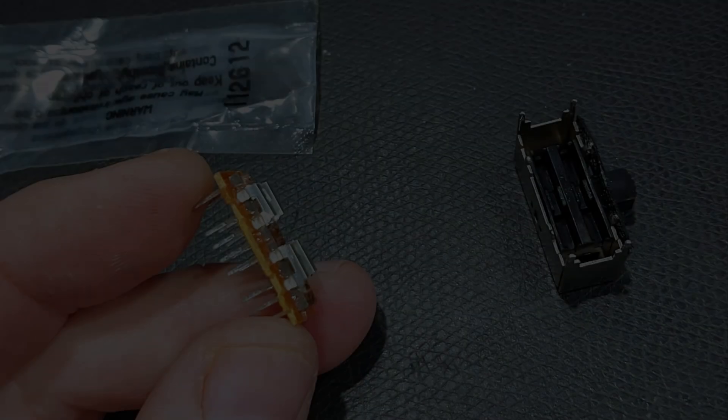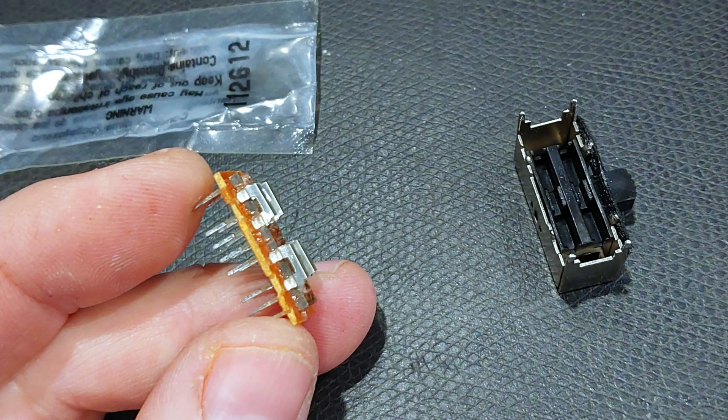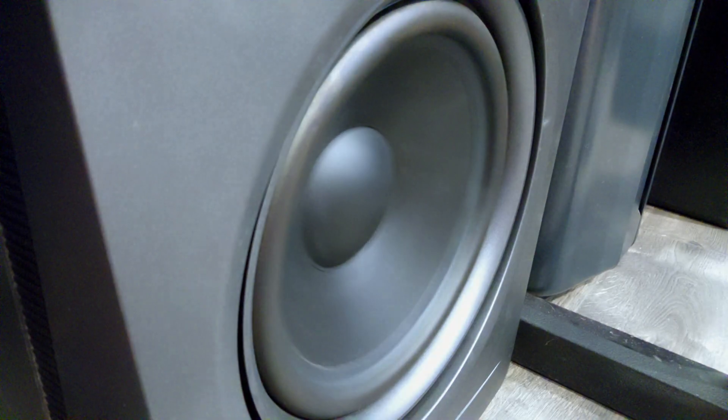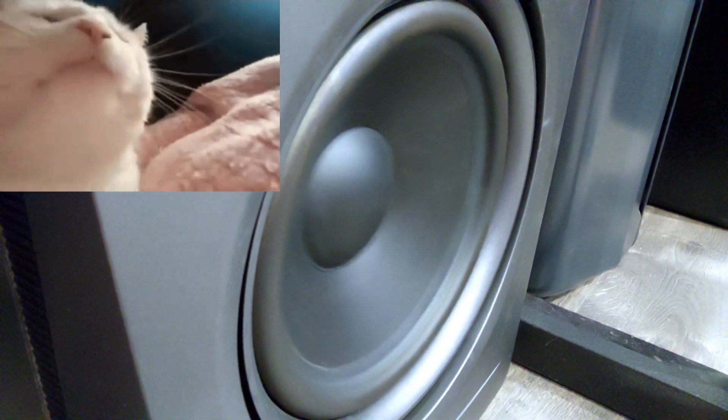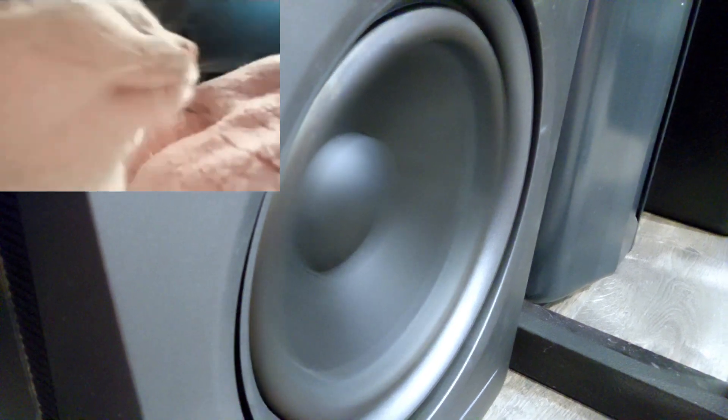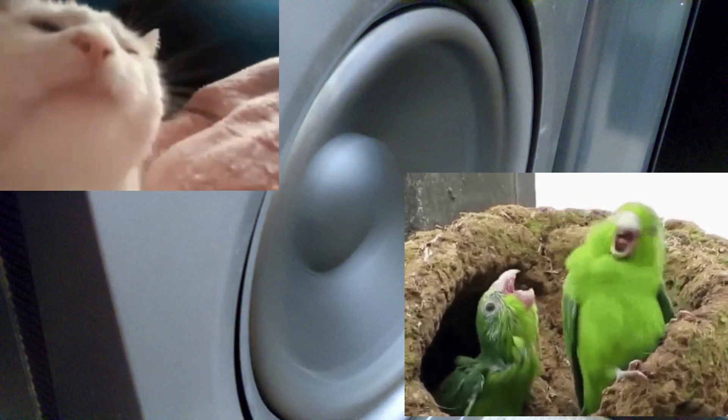As a last step, I used a little bit of silicone dielectric grease on the tracks and on the carriages. This will prevent that tarnish from coming back and won't cause an improper electrical connection — dielectric grease is not conductive, and used in a small amount the right way, it's not going to cause any problems. It will just help with the longevity of this switch. And that's it — I promised you a short video and a short repair, and that's all you have to do.